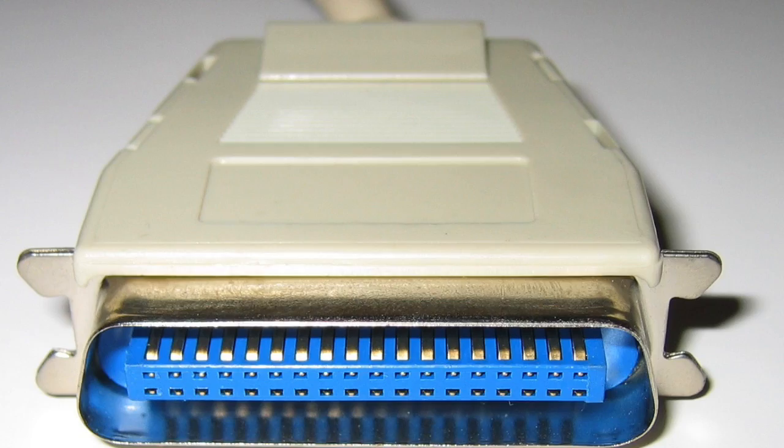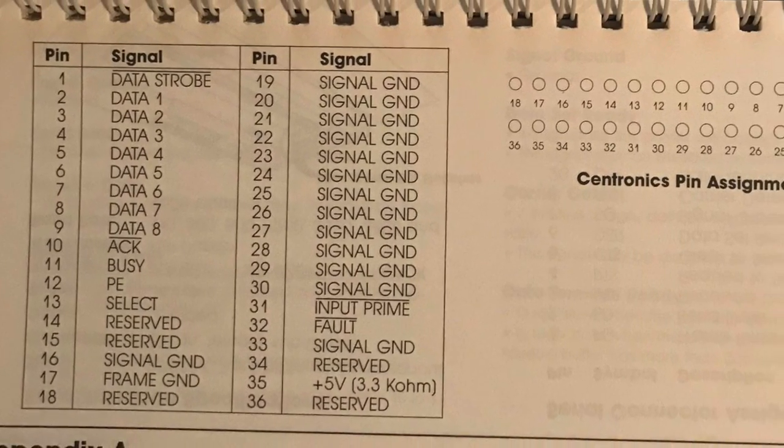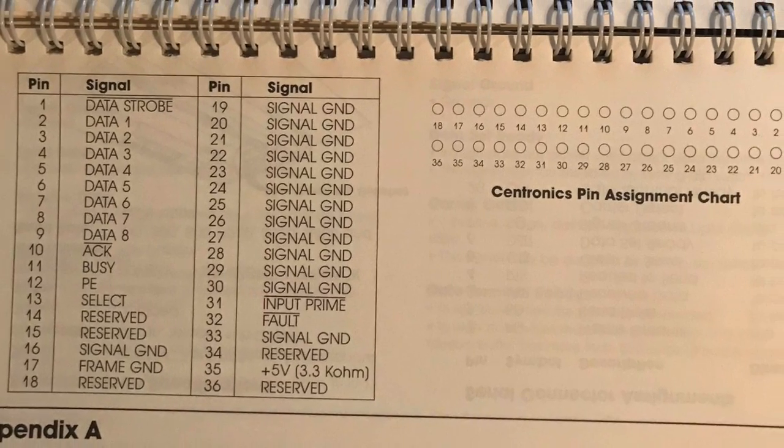Someone on Twitter said I could probably get an Arduino to control this thing, and I thought that might make a fun project. So I found some code for an Arduino online that lets it communicate with the parallel port printer, which this printer is. This is the communications port right here. This is a specific kind of parallel port called a Centronics port, or Centronics connector — it has 36 pins. It just has eight data lines and then a couple other lines for telling the printer 'I've sent data to you, read it,' and then a line for the printer to tell the computer 'I'm ready for another piece of data.' So you send it 8-bit characters, ASCII characters, and it prints them.